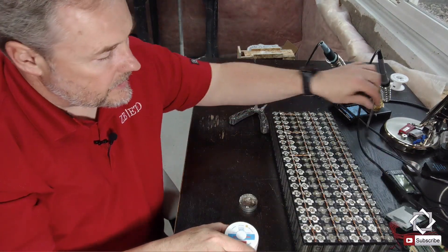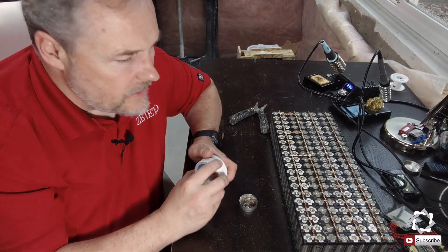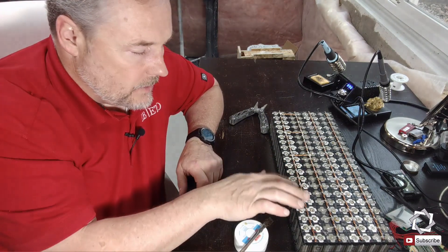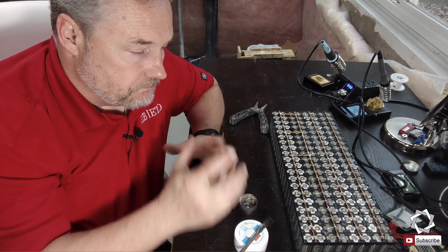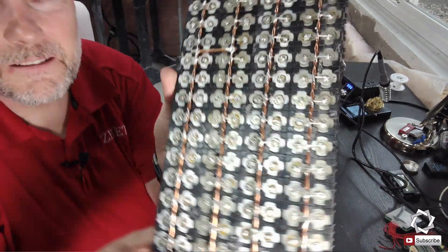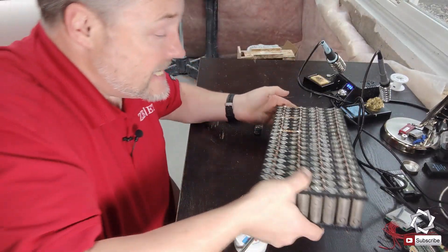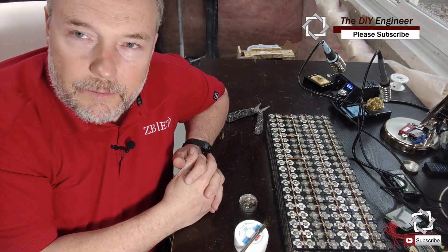The other piece of this is when you are applying solder to your cells, you need to make sure you use a good flux. You don't have to use a ton — just a little bit. I have a little brush that I apply flux with, and it gives me just enough so that when I do solder, the solder just lays right down without spending much time on the cell. Sometimes they come out looking a little dirty — that's just the flux. It's partly me learning how much flux to apply, and that's just a learning process.